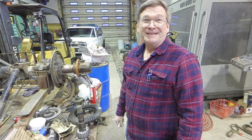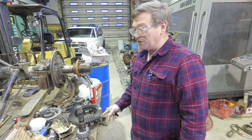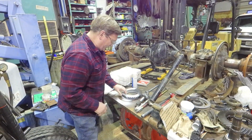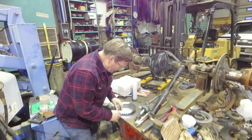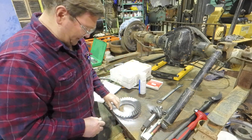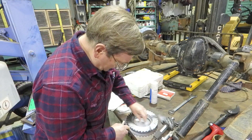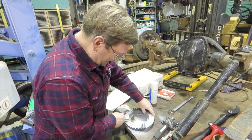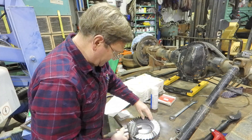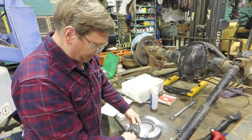It won't look like that when you first put it in — it takes a while to break in. That is perfect, unless it was very high precision and lined up perfectly. Now, this is the same nine-inch gear I was working with the other day. I had rolled it with the pinion held out on one side and you can see where it made marks, but it didn't make what would traditionally be called the mark you're looking for. On this one I got curious and did something I'd never done before — I rolled and scraped it while pushing it forward on the marking.